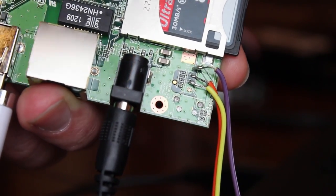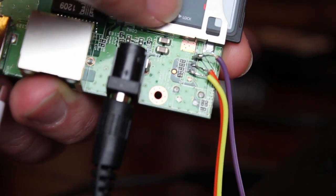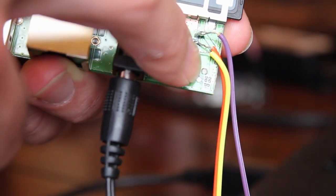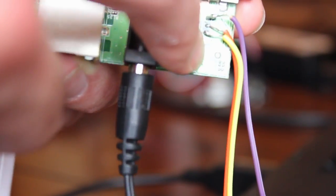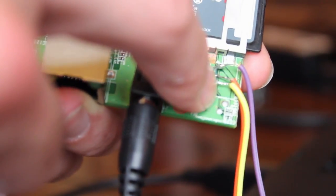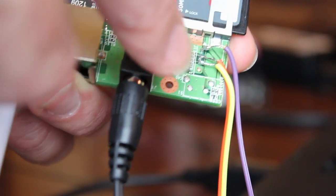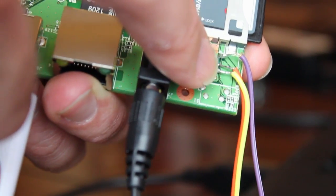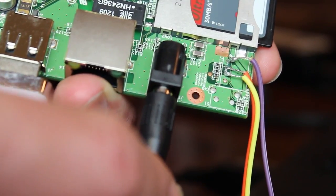In the description I'll link to all my notes and commands. Next to the SD card slot there are four little pads: ground, transmit, receive, and a voltage connection which we don't use. I soldered wires directly onto those pads since they were filled and I couldn't use pins. I'll put some hot glue on to hold them down and prevent the exposed wires from touching anything.